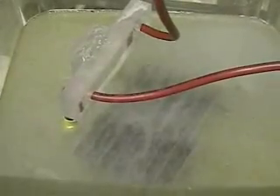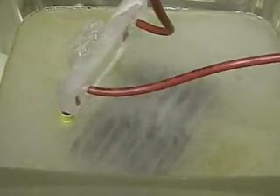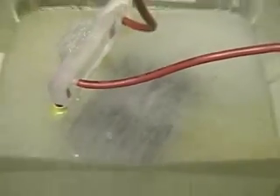So between the last video and this video, you could see the garbage in the last video and the amount of hydrogen that came out of the cell using tap water. The reason I'm showing you this long video is because the cell is not operating correctly. It should be putting out more hydrogen than it is, and we're putting in more than 13 volts at almost 10 amps.